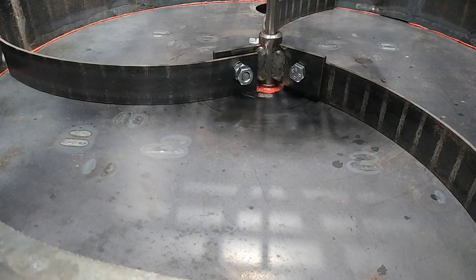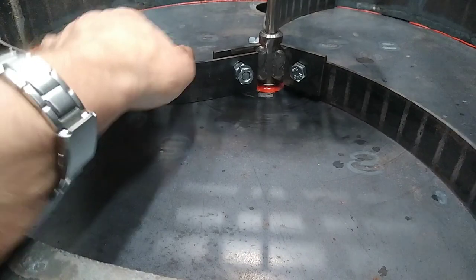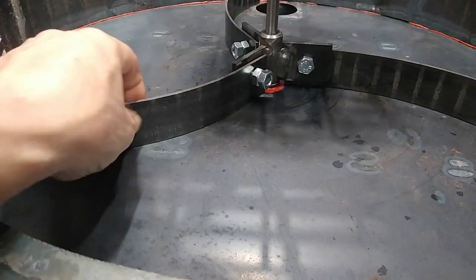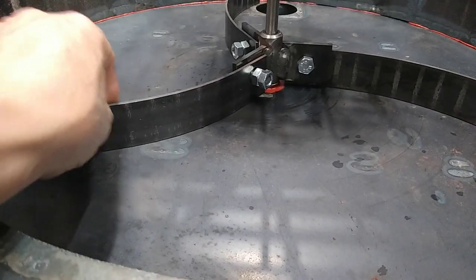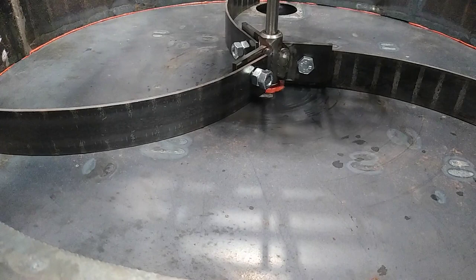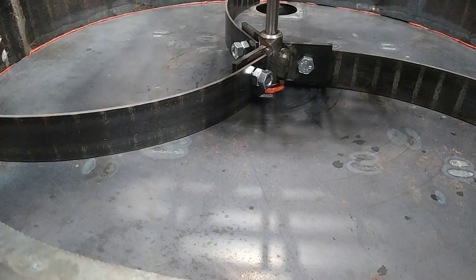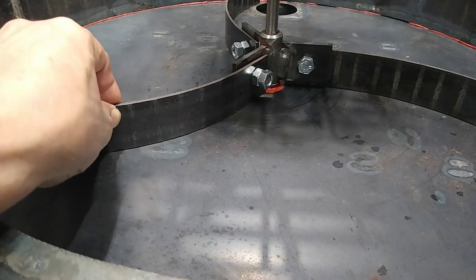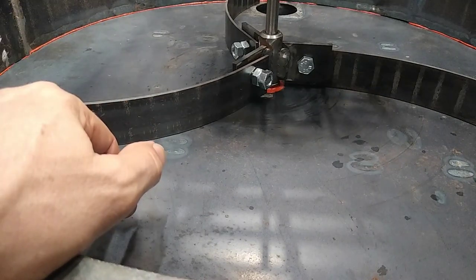And then on the floor scrapers, I did the same there. I lock nutted them by double nutting them. Same thing there, there's plenty of movement in the floor scrapers. That way, they're relying on gravity for keeping contact with the floor. If there's any lumps or bumps or anything like that, there's room for movement. That way, it's less likely to get caught up.